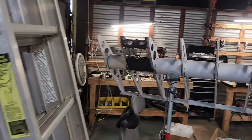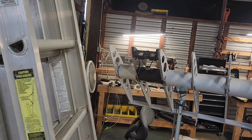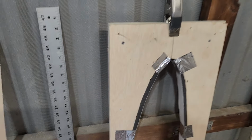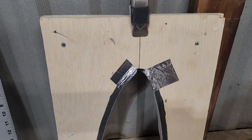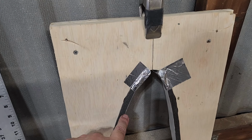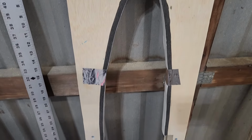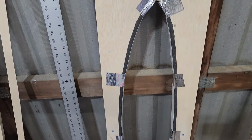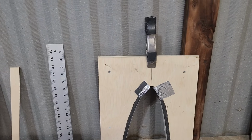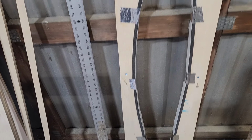I did put it over top of one of those ribs, and it's really, really tight, so not worried about it working. And I did all of these the same. I added a half an inch, give or take, because I didn't do a perfect job with the router. You can see it's kind of wobbly. But this is just a little over half an inch, and it worked out perfect. So it's very tight up against the rib itself, and with the addition of a layer of glue and the metal skin, it's going to be even tighter, so I think it's about right. And I've got roughly half an inch to play with as far as that stuff squishing up against the skin.